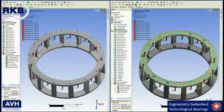The evaluation consists of simulating the behavior of both models in the same conditions by using FEM. The analysis was conducted in a simulated vibrating environment that can affect the cage. In this way, we consider that the vibrating environment applies a force of 1 kN to each roller on the cage cover. The 3D models created are subjected to finite element analysis and transposed into a static structural analysis that can emphasize the force propagation, the total deformation, and the equivalent stress appeared in the structure.